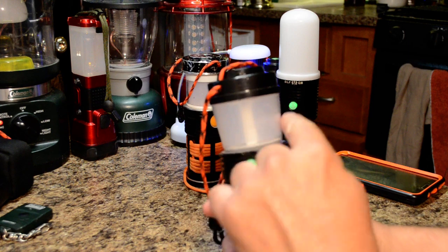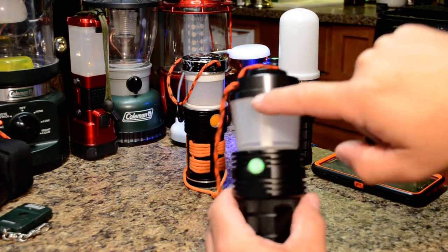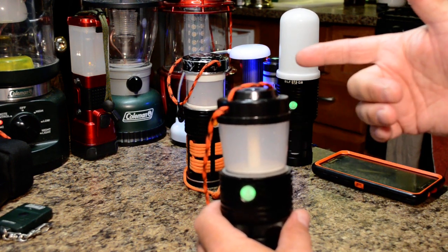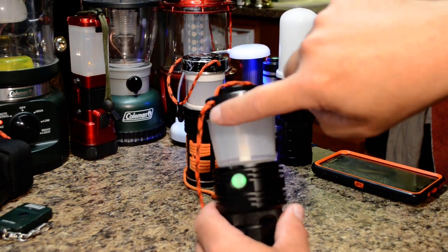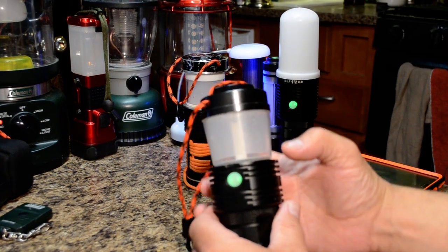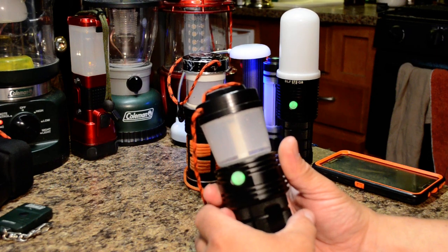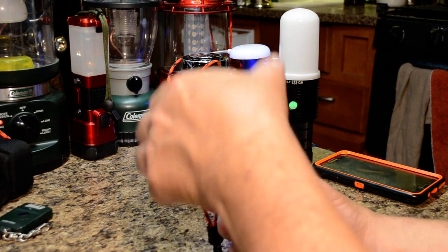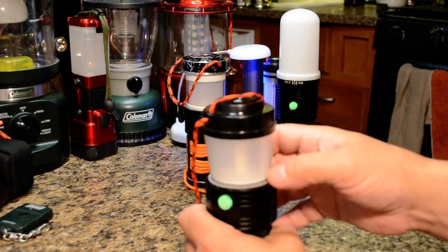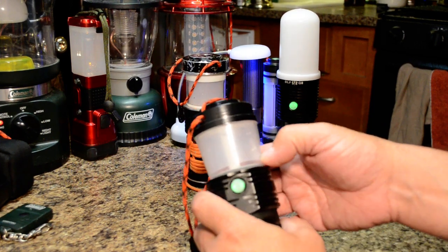The cup-shape design is much better than just a sleeve open at the top and bottom like some larger factory lanterns. If you look at the cross-section drawing in the BLF forum, the plastic material goes across the bottom as well, with a single hole down through the middle. This gives strength across the whole globe and makes it stronger than an open side sleeve.